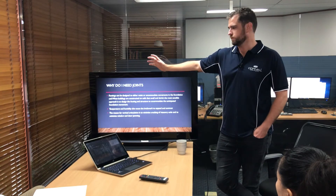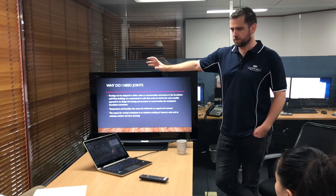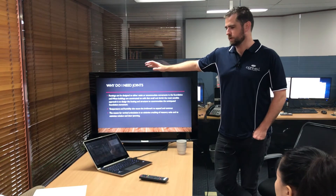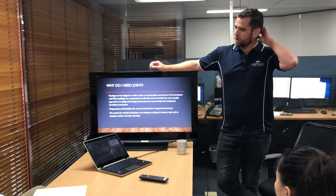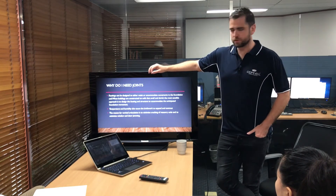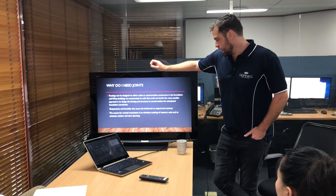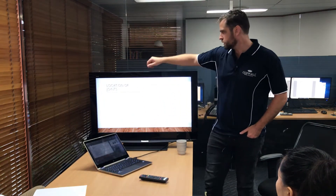Temperature and heating — very much in Queensland, you're getting hot climates where you get expansion of the brickwork itself. That's another reason we put in control joints, a little bit different to articulation joints but similar premise — we're allowing a section of brickwork to stress-relieve these areas because of the heat and humidity, and obviously to reduce the cracking overall.